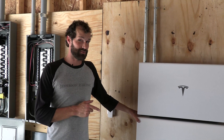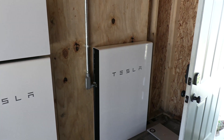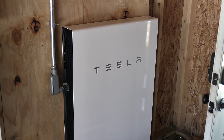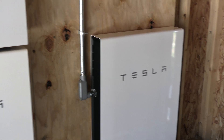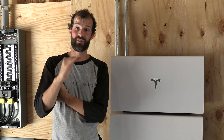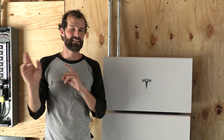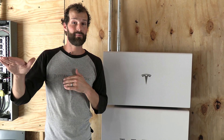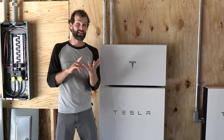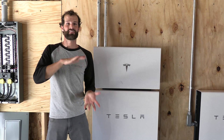Let's talk about the Tesla Powerwalls real quick. The Tesla Powerwall 2 is an AC coupled battery. It has 5 kilowatts of continuous power output, 7 kilowatt peak, 13.5 kilowatt hours of total usable capacity. One thing that's interesting to note is the Tesla will power down if it gets fully depleted. However, there's a reserve tank, if you will, at the bottom of that capacity, such that if the power comes back on, it syncs back up because it's AC coupled — so it's got its own inverter. It matches the sine wave of the generation source, whether that's the photovoltaic output, whether that's the grid, and then it's got enough capacity in reserve to fire back up.